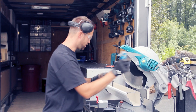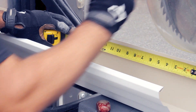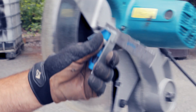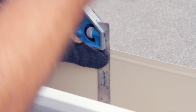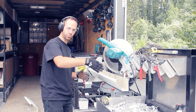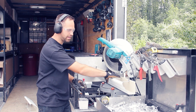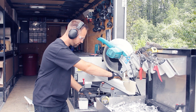Now I want to show you how to cut the outside corner on the other side. What I usually do is make a line with my straight edge, and once I have my measurement made I make my line and cut it about half an inch longer than my line so I have enough material to make a flap and put it inside the other piece of gutter. Just swing the saw the other way, make sure you put your bracket in and push it against the backing of the saw, making sure you have over half an inch clearance.